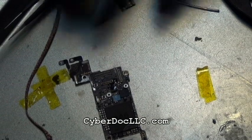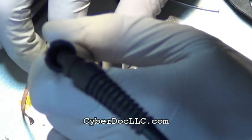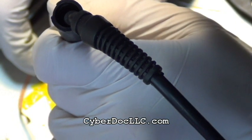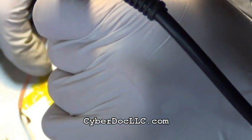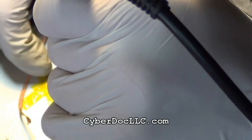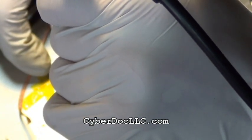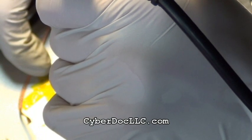So you put the new parts on and you heat it up with hot air at low temperature. You don't need, well, you could use high temperature if you want, but why risk it? Or you could, yeah, actually risk it. It will speed up the process. It's not like it's gonna damage the component. You can even use a 300 degrees Celsius hot air gun all you like.